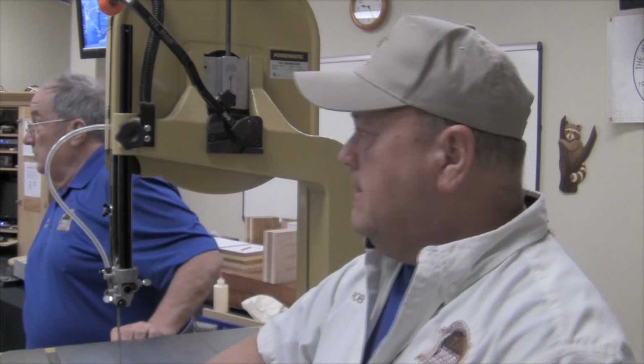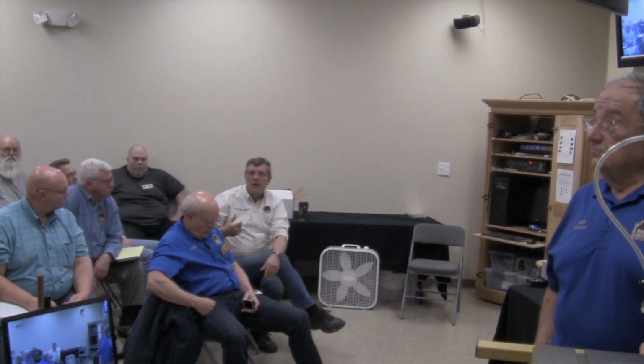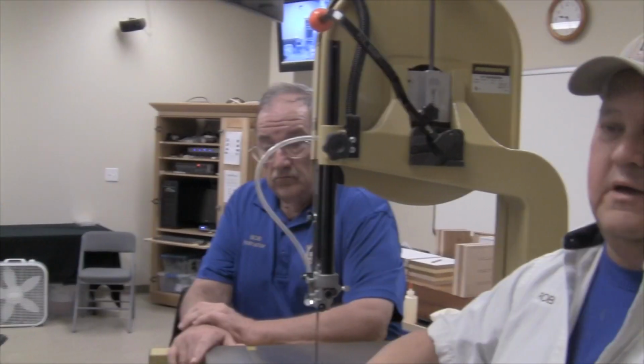Yeah, I've got that. You're twisting the blade, and I've used it with like a 3/16 and you can cut a circle almost the diameter of the blade with thickness with that system. It works. You can get some really fine, sharp turns with that system. You have to go at it slower, but you can make a sharper turn than what I would think I could do. I tried it when I used the cool blocks and the smaller blades like that, and the blades were just slipping off out of place completely. I could not make a sharp turn at all. In fact, if I started doing a sharp turn, I just got jammed up in there. It wouldn't do any good.